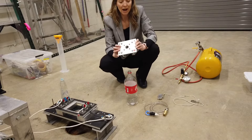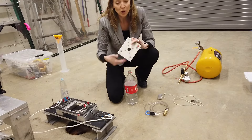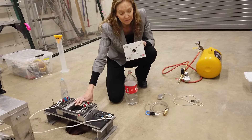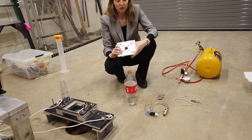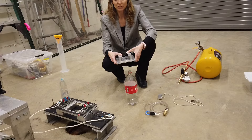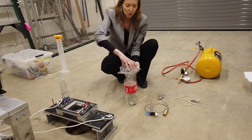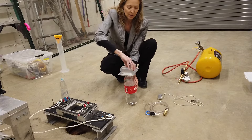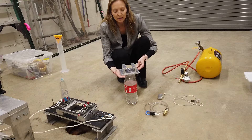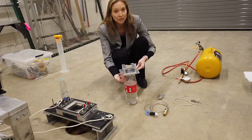Notice on this test stand bracket that there is a red dot. There's also a red dot on the top of the test stand. Those need to line up so that the tolerances of the plate match the tolerances of the rest of the test stand. The first thing to notice is where that dot is located, because you need to turn it upside down and line it up when you place it into the test stand. You can often feel for that red dot.